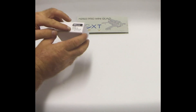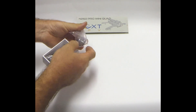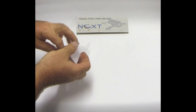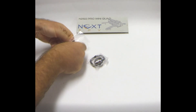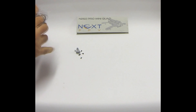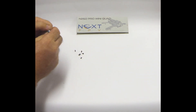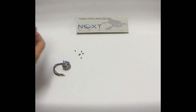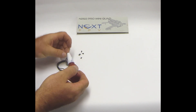For the motors we'll be using the T-Motor 2000KV — an excellent little motor that powers the quad very well on 3S and 4S. In the box you've got a couple of different prop mount options: a direct mount prop and a screw-on prop mount — we'll use the screw-on. The bag comes with a couple of extra screws, which is great. One important thing: when you put the screws in, get some Loctite onto the screws before fitting them. This is a high-vibration, high-stress area, so Loctite is essential.